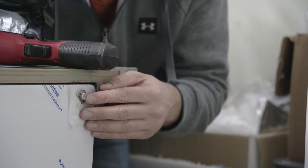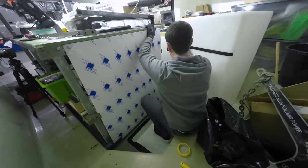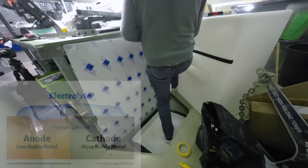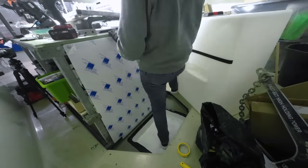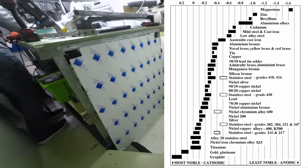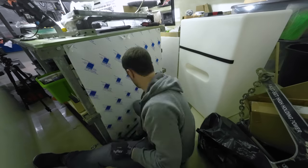Back in my early days on board Allan, racked with anxiety about galvanic corrosion and the absolute certainty from many that if mild steel so much as glances at a piece of stainless steel, the latter will immediately collapse into a pile of rust, I did consider a change, i.e. swapping out the stainless steel fixings in this galvanized structure for zinc-coated ones. But then I did the reading, and saw other professional builds with mixtures of metal types. I'm comfortable that far more catastrophe is likely to overwhelm Allan before stainless nuts and bolts at below 1% ratio compared to the galv steel box section and without seawater immersion start to eat away at the racking in a sort of galvanic cell induced end of days.